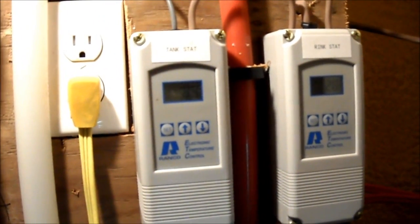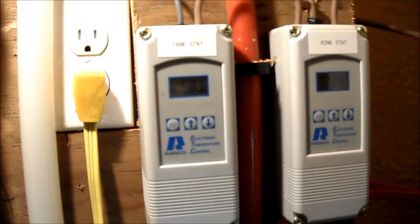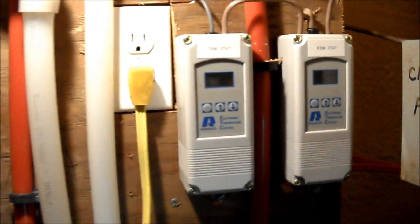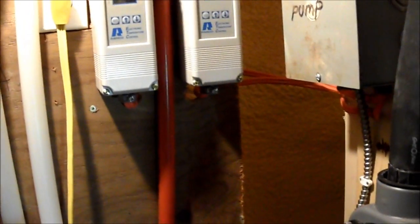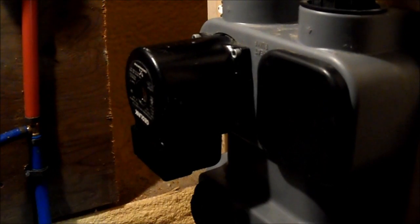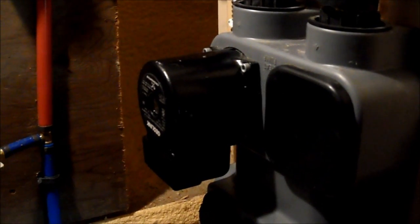We've got 84 degrees on our buffer tank hot water side right now. Once it hits about 80, with a 5-degree differential — so at 85 degrees with a 5-degree differential, once it sees 90 degrees — the floor is always running, but this loop pump kicks on. We've got a 6-ton horizontal loop installed outside, and we dump heat into that loop. We're getting probably about a 40-degree temperature difference — coming back in from the loop at about 50 degrees and going out at somewhere between 85 and 90 degrees.